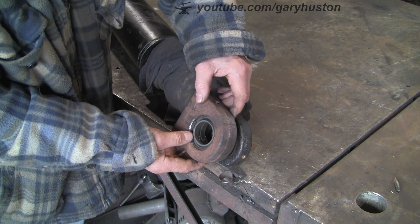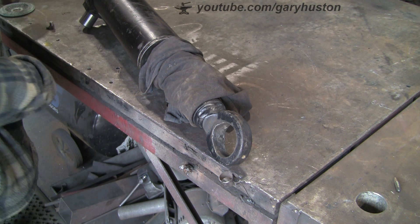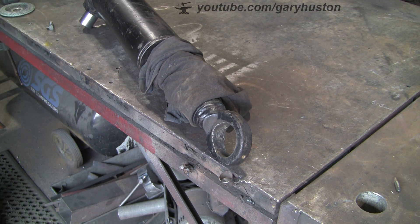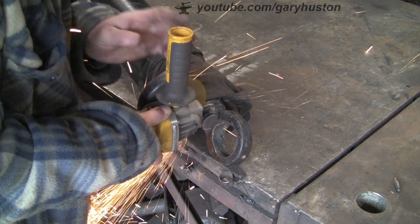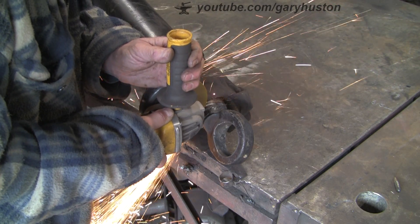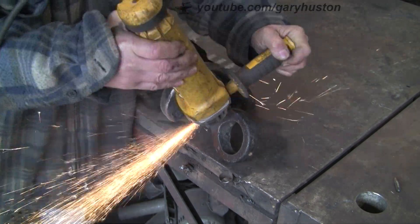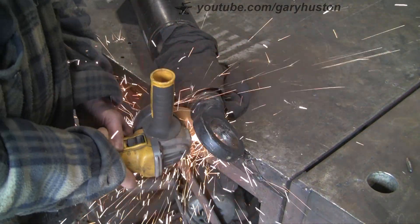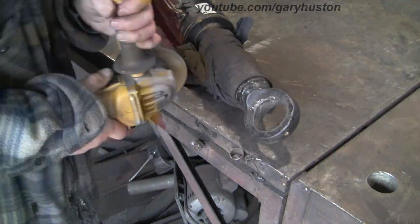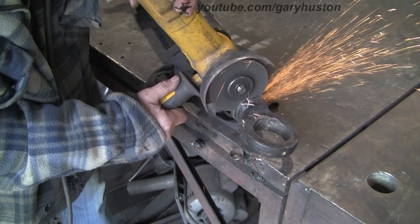Now I've worked out to get the bearing in the same place as the original, I've got to cut it right in the middle of the second weld. The only way I can see doing it easily is with the grinder, because I don't want to get the shaft or RAM too hot by using the gas axe or anything like that. So it makes sense to just cut it with a disc. I can't quite get all the way around with the disc - I think if I put a new disc in it might cut a bit more, but I'm about at my limit.